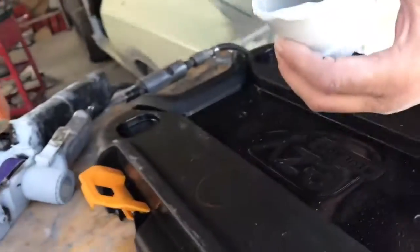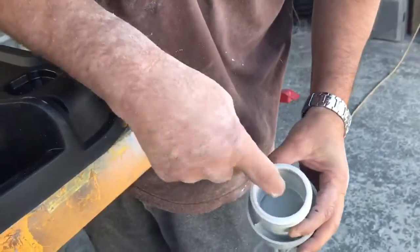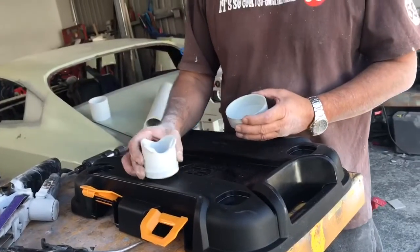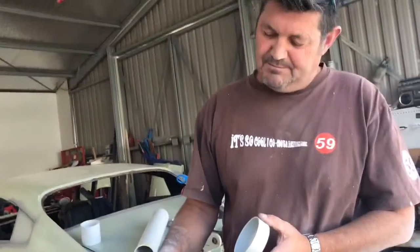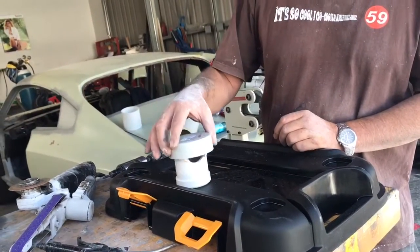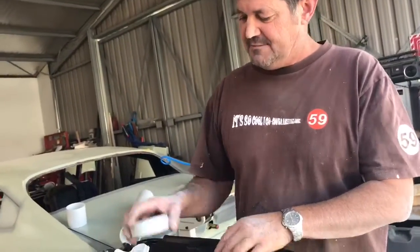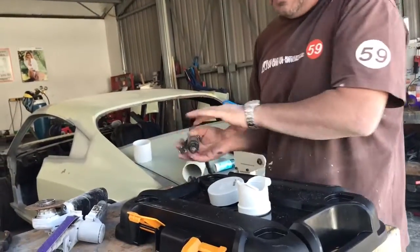So I just carved out a few big pieces like that. So if you look down in there, you can see there's plenty of places where air can get in really easily. So what I'm going to do is mill out a wee bit of plastic here. Then we're just going to urethane that on there. A couple of dabs of urethane in each corner and put the top on it, and that'll be the air intake into the box. All done. So we'll give that a bit of a go. See if we can just get through this plastic.